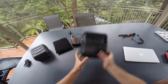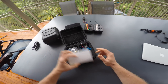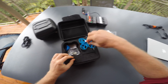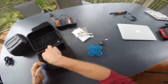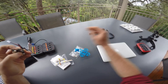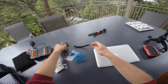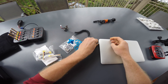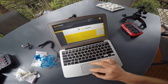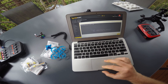When you have your ground station configured and batteries charging, it's time to put together or set up the model. We will have different versions of the kit available and you will either have to assemble the model yourself or it will be pre-built and pre-configured for you. If you have the unassembled version you will need to do a little bit of programming on the flight controller — now that sounds a lot harder than it is. I will show you exactly what you need to do. Connect a micro USB cable, which is not included in the kit, to a computer running Mac OS or Windows. Then download and start the Betaflight configurator and follow the instructions to install some drivers.